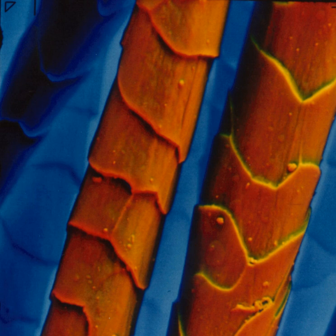In a simple form, the gaseous detection device employs an electrode with a voltage up to several hundred volts to collect the secondary electrons in the ESEM. The principle of this detector is best described by considering two parallel plates at a distance d apart with a potential difference V generating a uniform electric field E = V/D, as shown in the accompanying diagram of the GDD.